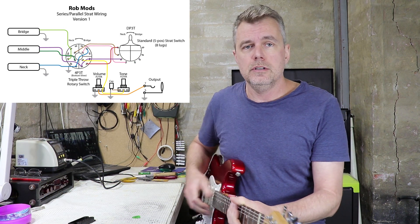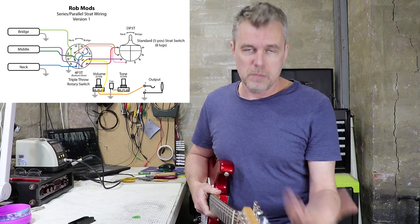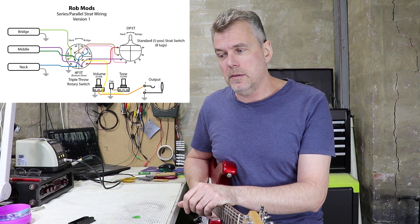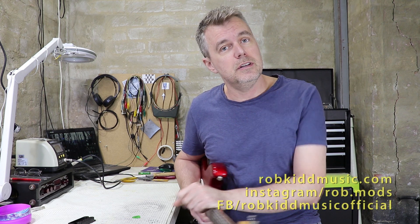For the first version of the circuit, the main advantage is that it's nice and cheap — you don't have to replace your Strat switch. And since you're only wiring to one pole of the Strat switch, it leaves the other pole free if you do want to add a second tone control. The flip side is that the rotary switch in the first version is actually pretty fiddly to wire, and if you're not into rotary switches, you're kind of out of luck — I'd be very surprised if anyone makes a toggle switch with four poles and three throws. As I mentioned, I'll put all of those diagrams in a PDF on my website, so do check them out and let me know if you have a go at wiring them with your project guitar. I hope you enjoyed the video — please like and subscribe, and thanks for watching. I'll see you in the next one.